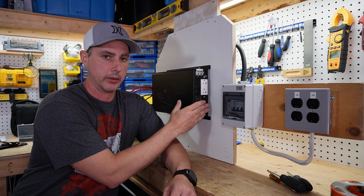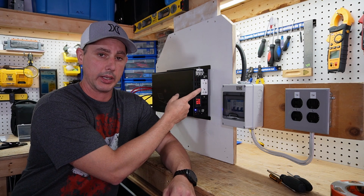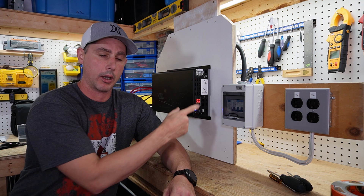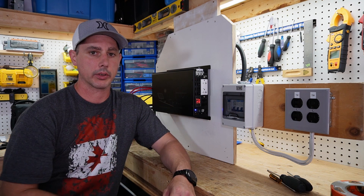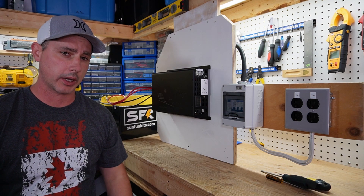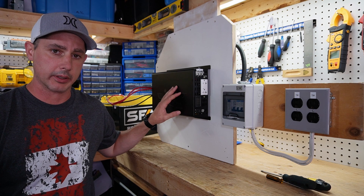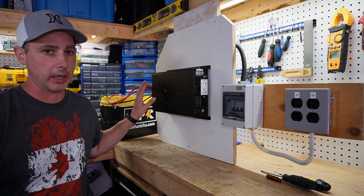Now that we have the battery set up, we're ready to fire on the inverter. This is your front control panel — on/off switch and a 20 amp plug outlet. Most units only come with a 15 amp outlet. If you are going to be using 20 amps AC, I suggest using 12 gauge wire instead of regular 14 gauge for your extension cords. Hooked up to one battery this gives you light duty use — you can run a TV and some electronics, but to run the full 3000 watts you'll need to change your battery configuration.